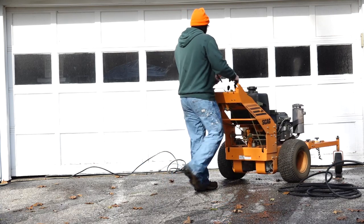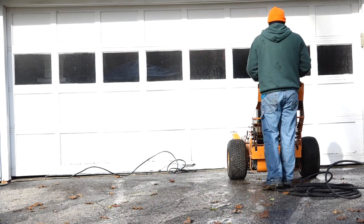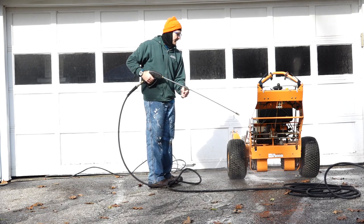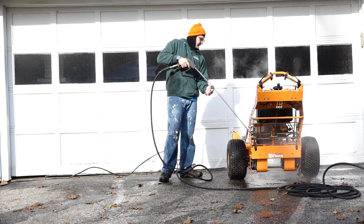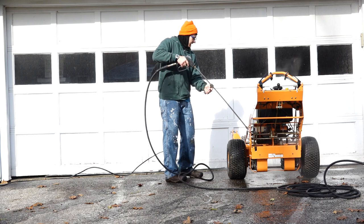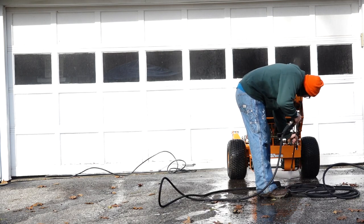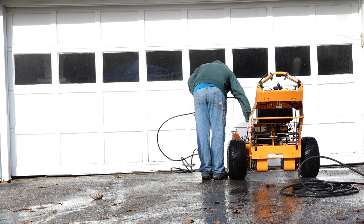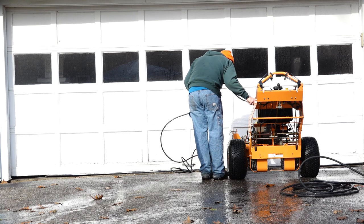Move the mower into position for cleaning — the front should face the garage door. Clean the mower. As there are many sensitive electronic and working parts, focus only on cleaning problem areas like where the engine meets the mower body and the areas around the hydraulic wheel motors. Otherwise, just lightly rinse. Use compressed air to remove water buildup, especially in the hydraulic motor fans.